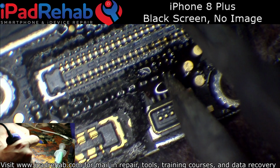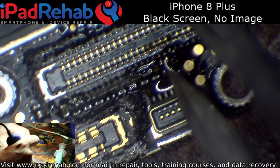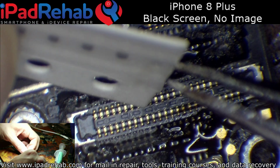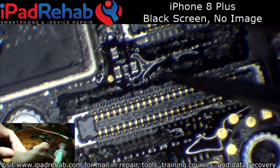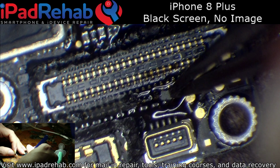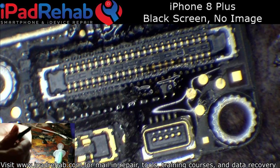Probably not picking it up on the camera very well, but I just picked up pieces of the choke off of the two pads that were closest to the connector, so that choke was definitely damaged. These things are just another type of inductor, like a filter or a coil. They're essentially just a coil of wire inside, and you tend to find these in iPhones and iPads on any kind of data lines, data and clock pairs that carry image data. So you'll find them near the camera connectors and the LCD connectors.